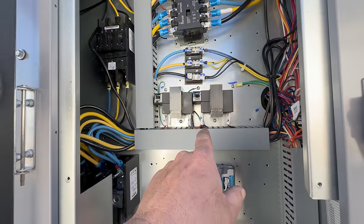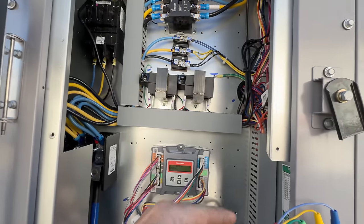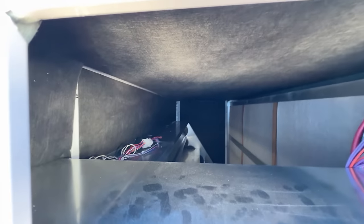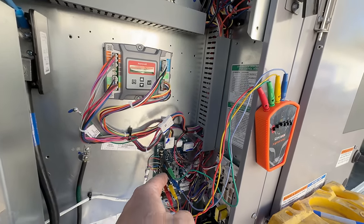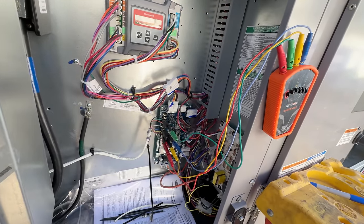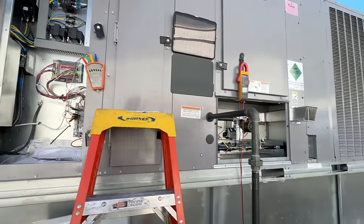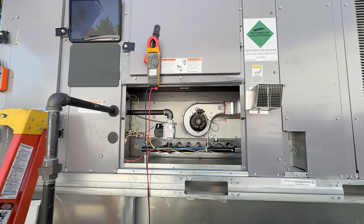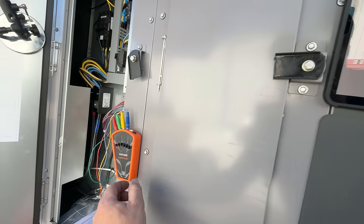I switched my voltages around here — made it a lot quicker. Pulled that wire across and was able to wire tie it up. Didn't have no power to my board because one of the smoke alarm wires pulled off. Nothing went into the fans this time, which is kind of nice. Heating is done — 35-degree rise, same thing I had before. 28 degrees on low.